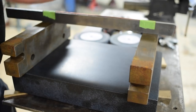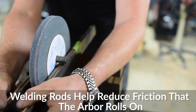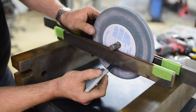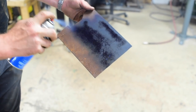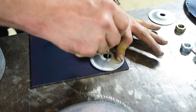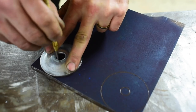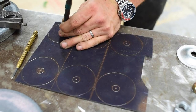So when you get one of these, what you want to do is set up a relatively simple setup. I've used a machinist surface plate for this, but you can use any known flat surface — say the top of a table saw, a flat workbench, whatever. You want to level it, and then find a piece of steel shaft or cold roll bar that fits perfectly in the arbor hole. Put that shaft through the arbor hole, set the wheel on a set of straight edges that are leveled, and allow the heaviest point of the grinding wheel to pull itself down to the bottom. Then take a marker and mark that — you know that is the heaviest point in the wheel.